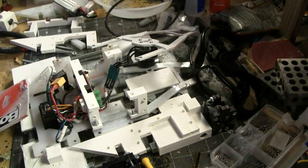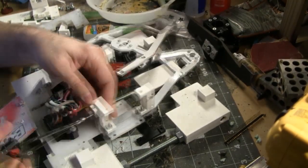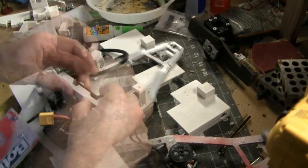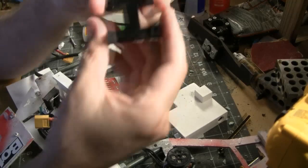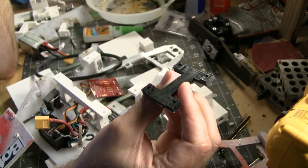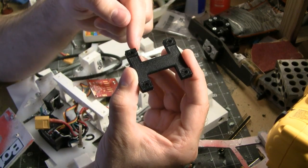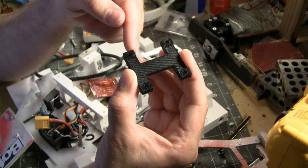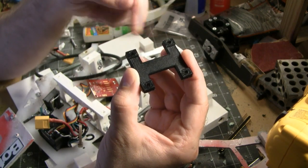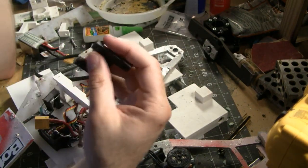The redesigned side piece is being printed off right now. Let's install what is hopefully the final version of the rear structure. Another little facepalm: the tray I use to hold the ESC in place was brought over from Microflash Gamma, but now that I've redesigned the rear structure, it doesn't quite fit right. I'm going to chop it up a little and make slight modifications to make it work with the newer rear structure.